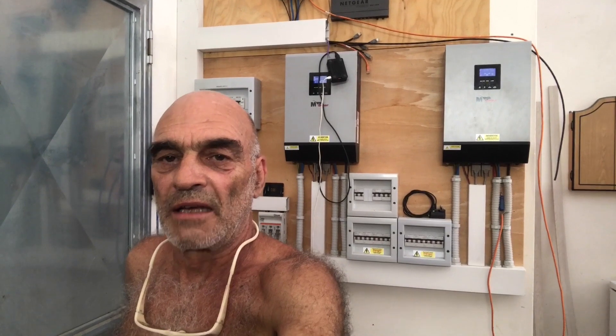The current maximum power I can supply is 8 kilowatts, which is fine for one house. When I sized the system it was only really going to be for one house, but circumstances changed. I could do with another 4 kilowatts of power, to be honest. So I've got two options: I can either replace the two inverters with two six or eight kilowatt inverters and run them in parallel, or I could try and find another MPP inverter to match what I've got and parallel that one up to give me 12 kilowatts. Still thinking about the best way to go about it.